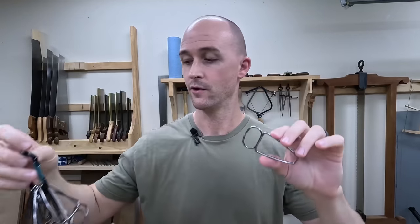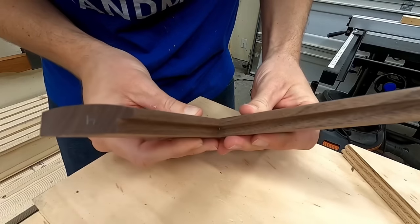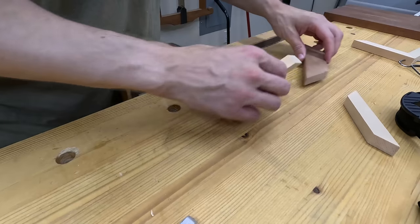You can put the pressure on different areas of the miter. It doesn't need to be a perfect 45 degree angle like you would need with a band clamp. A simple miter — just a plain miter — is child's play for these spring clamps. Another huge advantage is that you can easily align the inside corner of the miter when you're doing your glue up. That's super handy because if you have one side that's a little bit wider than the others and you align based on the outside corner, you're going to have a jacked up looking picture frame with really no easy way to fix that.